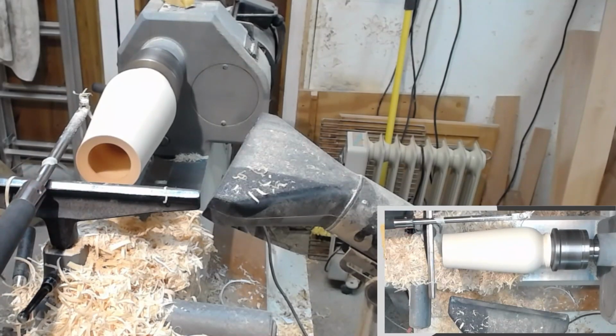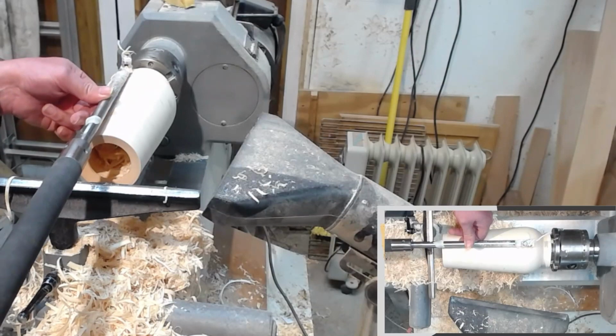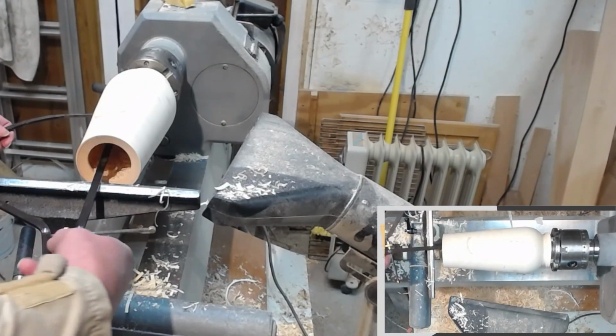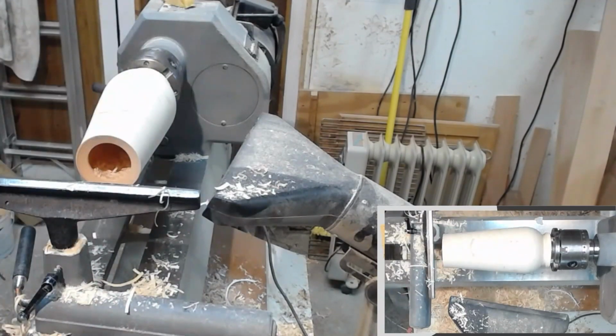As you can see, I've achieved what I was after. My bit of tape is level with the entrance, and I've reached the bottom, and not gone through, I hope. Check my sidewalls. It's about 5mm, 1/4 inch. Job done.